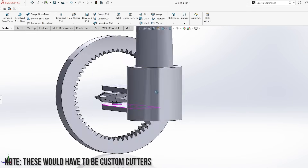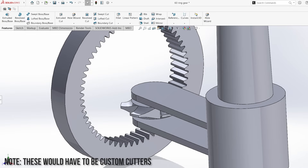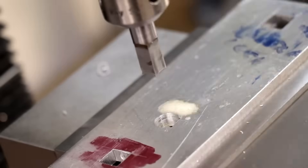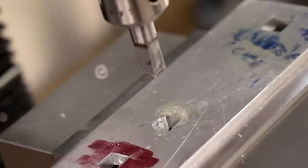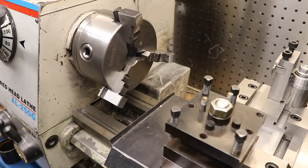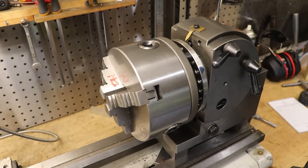I could make some sort of horizontal milling attachment to get the cutter down through the bore of the gear, but I think there is a much easier way - at least for a proof of concept - and that's simply to broach it. I've done it for square holes, spline shafts, and keyways, and I don't see why I can't do it for gear teeth. The easiest setup will be to use the lathe and the carriage, and now that I have the dividing head mounting system, I don't have to worry about how to hold and index the gear.